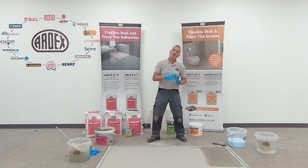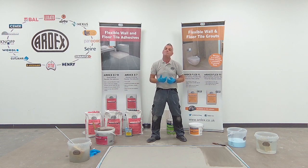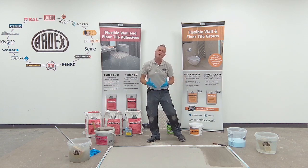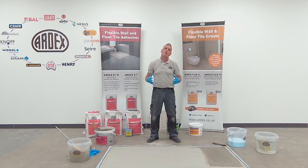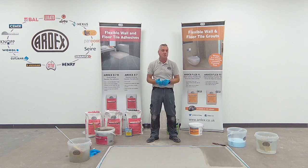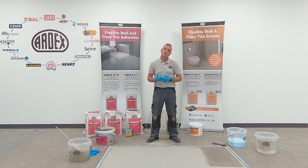So with regards to the primer itself, just be mindful that if you prime something, you will maximize your open time, but also what you've got to consider is the types of adhesives that you're going to be using. As you're aware, within the ARDEX range, we have a range of different products, and the range of products are there to meet your needs. And that could be down to drying times for grouting. It can also be down to the substrate you're going on to, but also the types of materials that you're going to be installing, such as natural materials and stone.